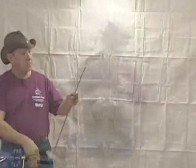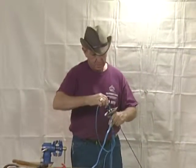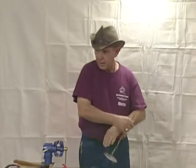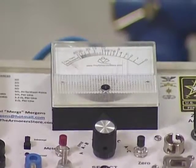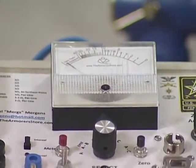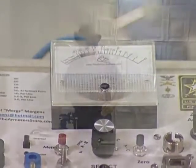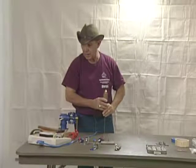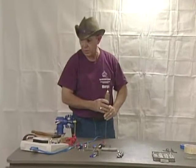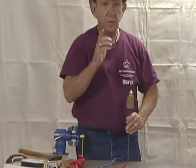With the weapon put together, connect it up. On the meter I'm getting 1 ohm, and when I depress the tip it comes back — the weapon is working. Checking the tip again: pull it down, and it hesitates before returning or sticks, which means we need to go inside the tip.